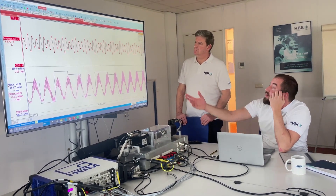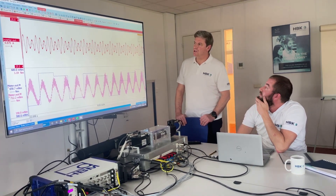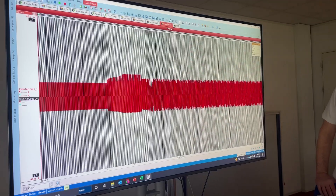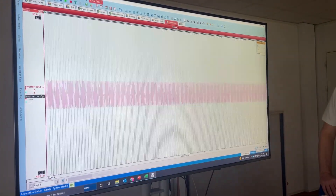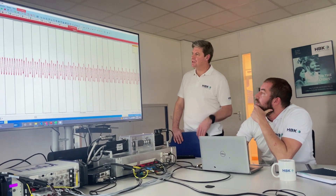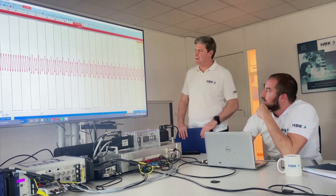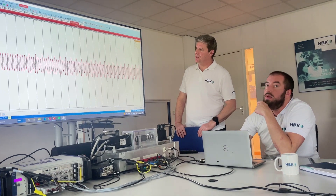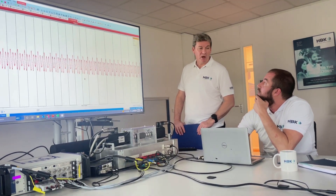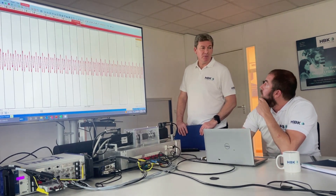Noise and vibration obviously, and inefficiency — this isn't necessarily great for the machine. One assumes vibration is not good. So let's look at the acquisition side. If we go to cycle detection — this is all recorded data. You're trying to put in a nice sinusoidal current, but because of the design of the motor, you're just getting distortion. It's messing things up. This will create torque ripple, and that torque ripple will create vibrations. A vibration will impact passenger or cargo, and it will impact durability.